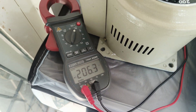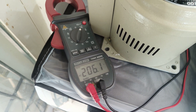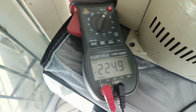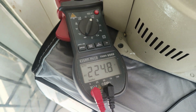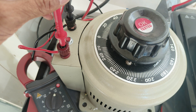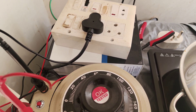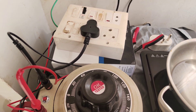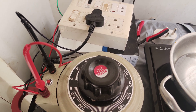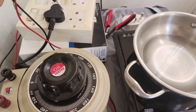The input voltage is 206 — you can see the input voltage is 220, regular 220 volts, around 224 volts. Now what I will do is change the input voltage and then the output of the stabilizer should remain constant — that's the use of the stabilizer. So if it goes beyond 230 it should reduce the voltage, or if it goes below some level it should keep the output voltage constant. Let's see if it really works or not.